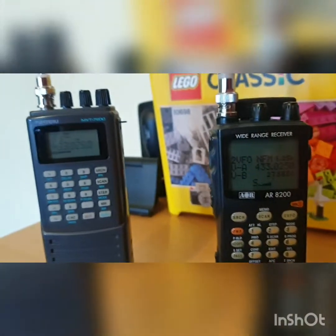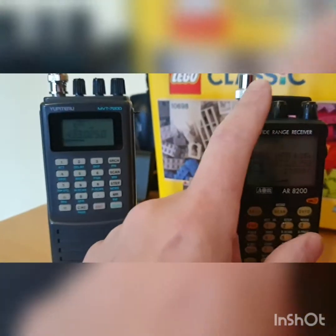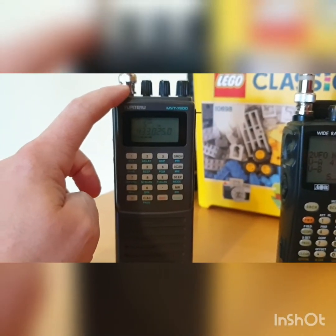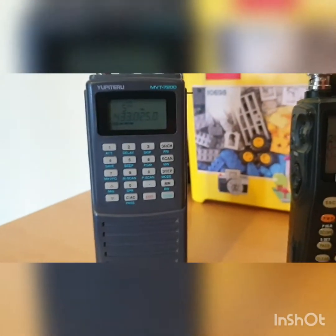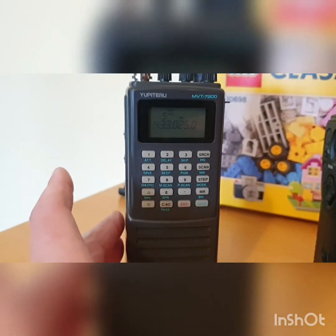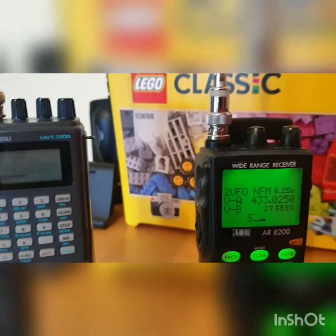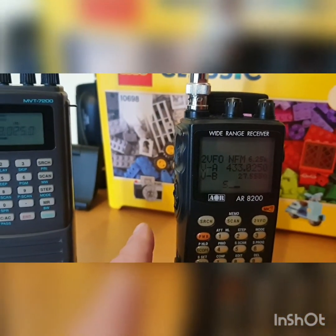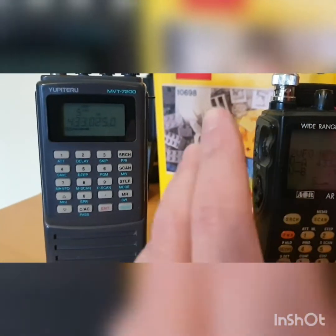All the filters in the AOR are analog filters. It's got 3kHz filtering for SSB, and I think 2.4kHz which is a really good filter — you get a very similar SSB filter in the AOR 8600. That's another difference: the AOR has narrow AM and a better filter on sideband than the MVT 7100. The AOR is digitized and computer-controlled in places, but still fundamentally an analog system.